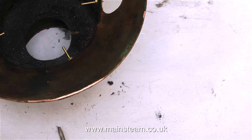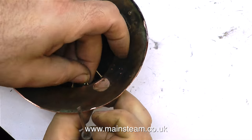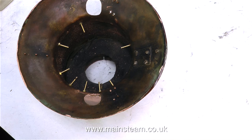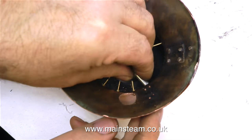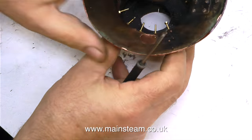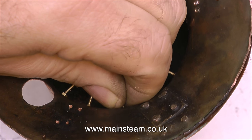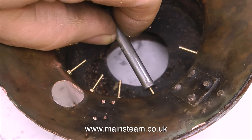In the case of this boiler top cap assembly, it's quite badly damaged. The vertical tube part was originally riveted to some very thin metal on the tapered lower part that fits on the boiler. I think I can take an educated guess at what happened: the chimney is quite long and at some time in the past it had quite a heavy impact, which tore the entire assembly off the base plate. The only reason the assembly did not fall out of the boat completely was because the steam pipe to the engine, the steam pipe from the engine, and the smaller pipe to the whistle held it in place. This is not a good state of affairs, so what I'm doing is repairing it properly.